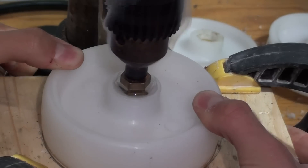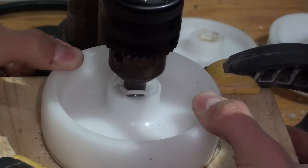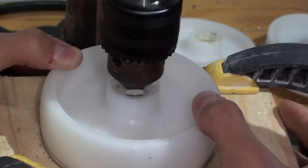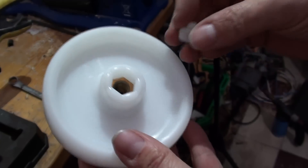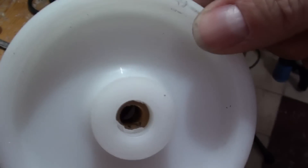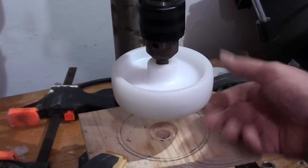We've got this set so that when it's fully in the down position on the pillar drill it should be in the right position in the centre of the wheel — trial and error on that too. Now we've just got to hold that pose until the plastic sets, which will be a minute or two. Here's the product at the next stage: you can see the brass is centred in the middle, and under the bottom there's a little plug of molten plastic that comes out. We've simply turned it over, knocked it through with a screwdriver, and it pops out quite easily, showing the ends. That one's not very neat because that's where the plug came out, and there's a nice little molten pattern at the top which unfortunately we have to cut off.